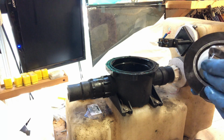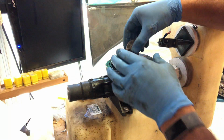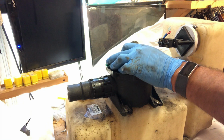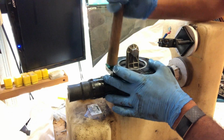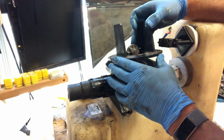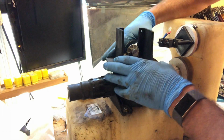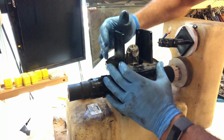Your upper arm of bellows is in line with inlet and outlet fittings. Okay, so they want you to make sure that this is parallel with the line of travel, so you don't end up like this because your motor doesn't fit that way. Okay. Looks like put this thing back together. Now this is where we got to be careful not to push that O-ring out of position. Oh, there we go. All right, feel around on the inside of that, make sure that O-ring didn't fall out. Okay.